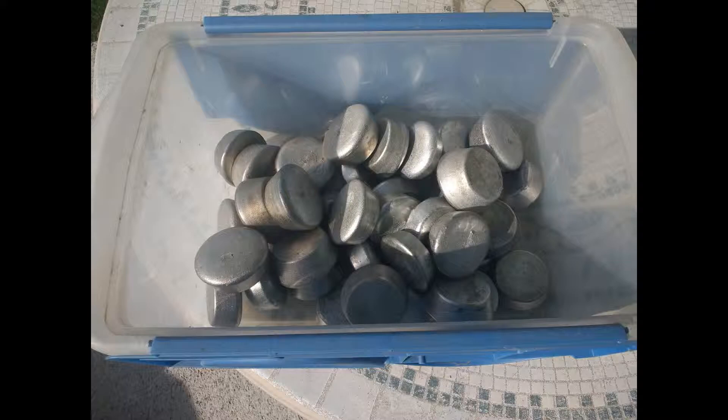But in the end, since the temperature I'm getting up to wasn't enough to melt copper, I wasn't too worried about cleaning all of that out and I found it much easier just to take the hard drives in whole, toss them into the bottom of my crucible — in this case that cast iron pot that we've seen in previous videos. These drives fit probably about four or five standing upright in there, so it made melting down these drives much quicker and easier than had I spent the time to dismantle everything.